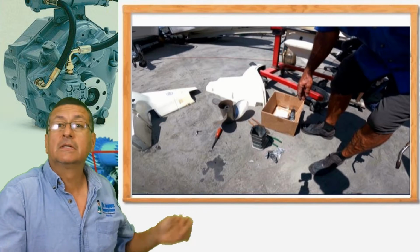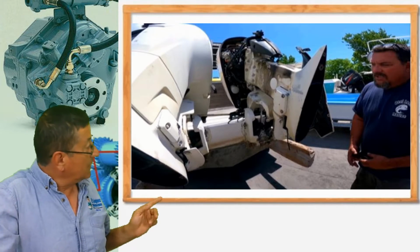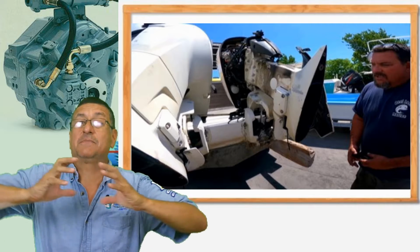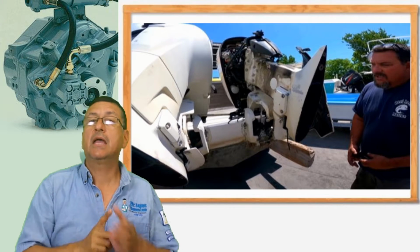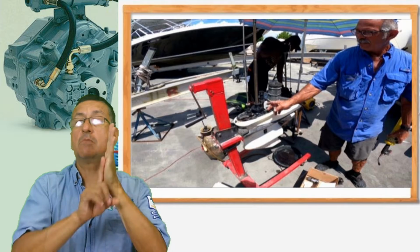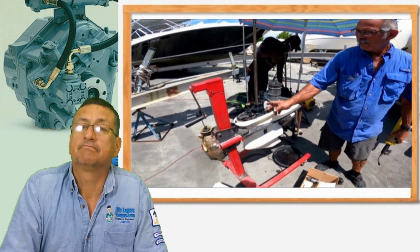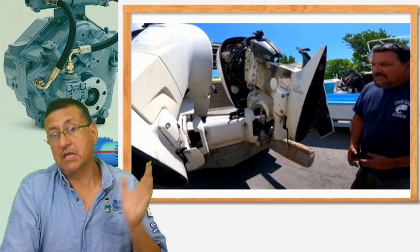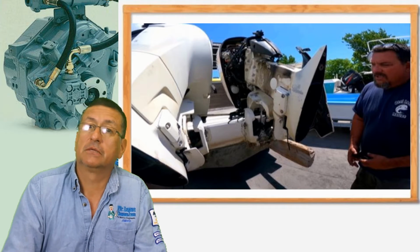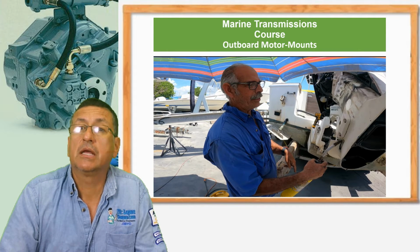You see, it's melted. And the rubber on the motor mounts, located on each side of the outboard, like you see over there, is melted. The rubber expands, the motor mount expands and affects the movement of the drive shaft against the motor mount. At some moment, it's impossible to engage the gears. The situation was on the port side, but on the starboard side, we found that both motor mounts were also destroyed. For that reason, I spoke with Robert, the marine technician at Real Loco Marine, and he explained the situation.